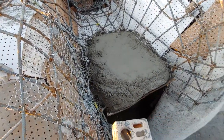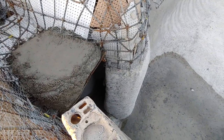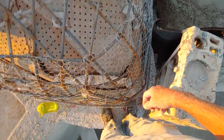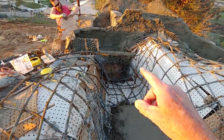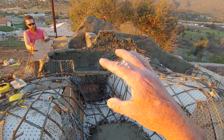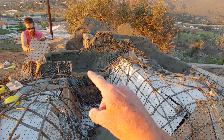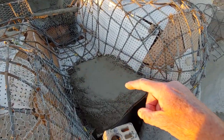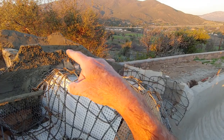This is the front section of the weir, so that thing locks the whole thing. You can see how much we've already done - this much of the feature. All that concrete we shot when we shot the pool. This thing is not going anywhere - it's all half-inch, really fat and happy rebar. We got our starting pond right there. We're pre-placing mortar mix mixed with concrete. The starting pond's right there and then it's going to well up, dump in here, come across here, and get back out into the pool and cycle around.